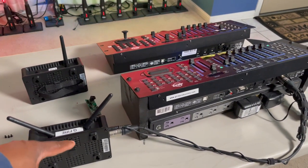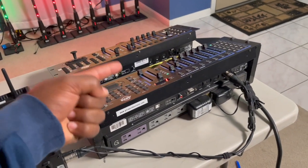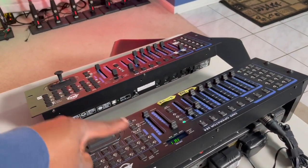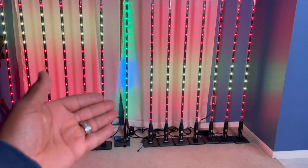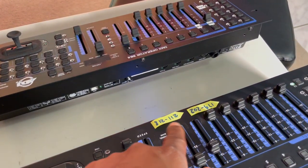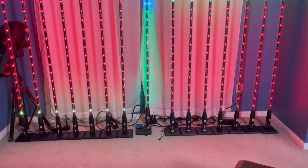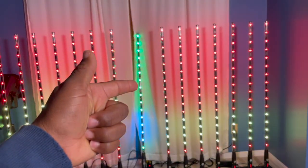I swapped the Flare Con out for the D5 hub in transmitter mode, and even swapped this DMX controller with an identical one — but it's still doing the same problem in the same area, according to the sticky tabs here. So the only thing I could think of at this point is there may be a potential problem with the LED assembly.